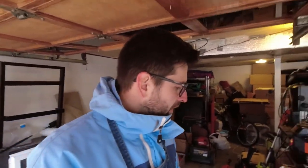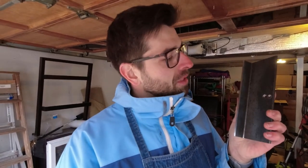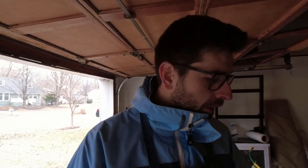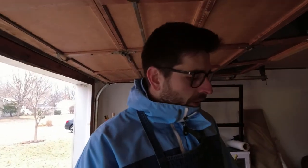I stupidly, and you guys might have caught this in the video, I drilled the first hole with a 3/8 bit, which I was planning on tapping to a 3/8 bolt, and you gotta use a smaller bit, obviously. And so what I did was, I drilled me another one. It's all right, though. It's not gonna harm anything if there's another hole there, and that keeps me from having to run to the store for, what would that make it? 3/8, what would it make it? 7/16 or something like that, maybe. Yeah. So whatever, it'll work.